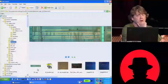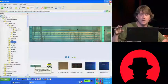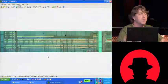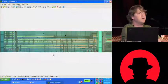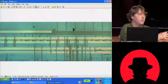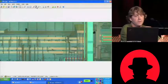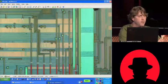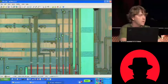Microtech is this Chinese smart card company. Microtech used the same exact flash from TSMC, except TSMC said, oh, now we have filler metal on the surface, so it's more secure. Something like this they're going to probably be peddling. But I've already studied the flash on the older Freescale parts that you can buy, the 908 series of Freescale. And so you can see here the ordering of the flash. The chances that the user that designed into this TSMC process modified these lines is almost 0% possibly.